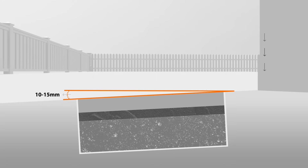If you need to cut pavers, hire a paver cutter, or you could use an angle grinder with a diamond tip blade. All my pavers are laid, they're looking great. So the next stage is putting my pave lock in. Now what this does is help bond all the pavers together, and a good thing about it also, it stops any ants or weeds coming through the cracks.